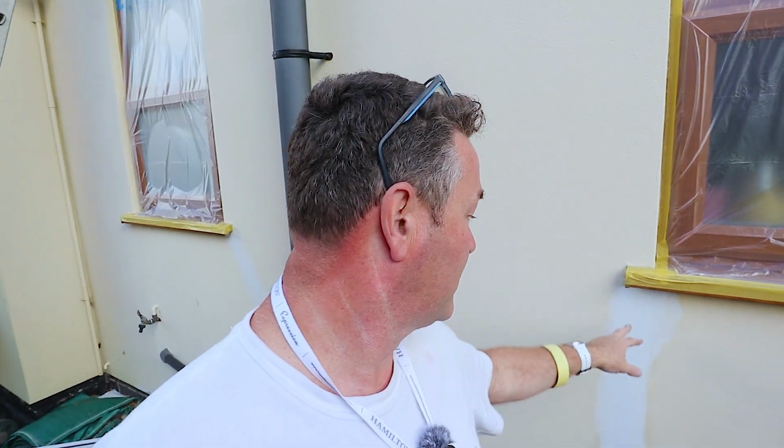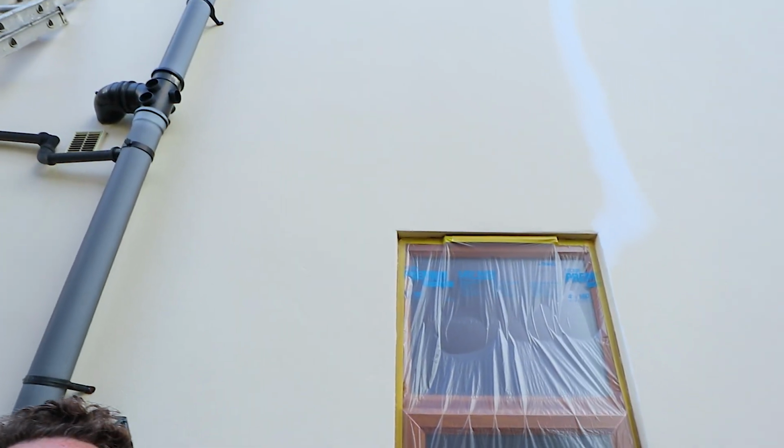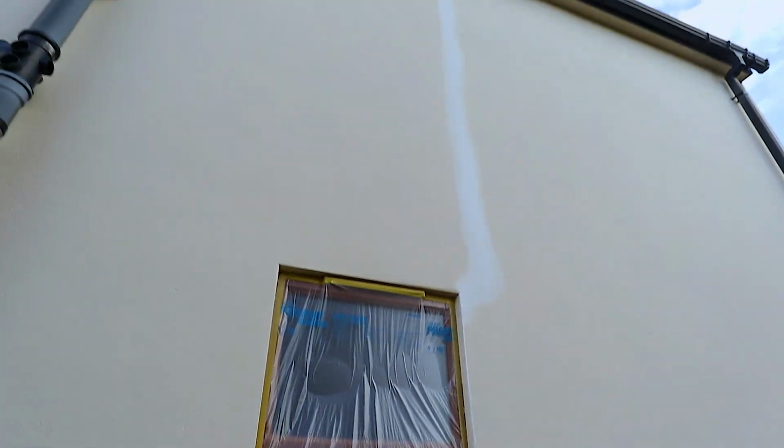But now I'm on this side of the house that I have, and I've said in previous videos, I've got some historic cracks in the render, and I'm looking at the camera to see it here. Historic cracks in the render. It's there, and if you can just see, goes all the way up there. Now, over the years, I've done everything to it. I've raked it out, put exterior fillers in, I've put all, what you name it, I've done it.